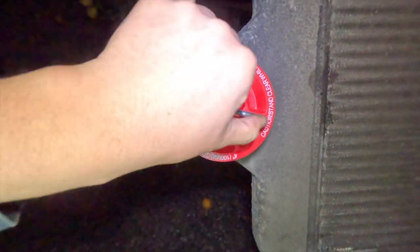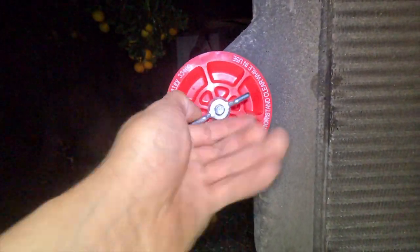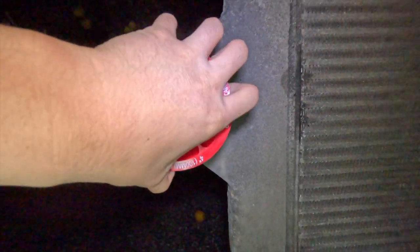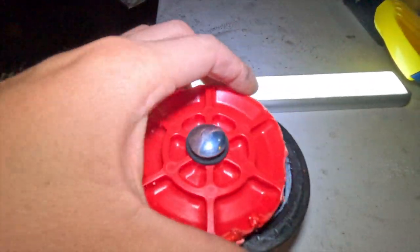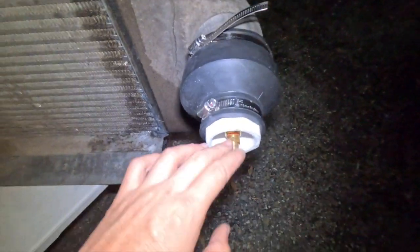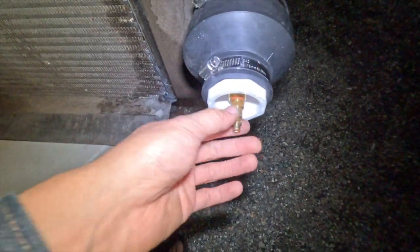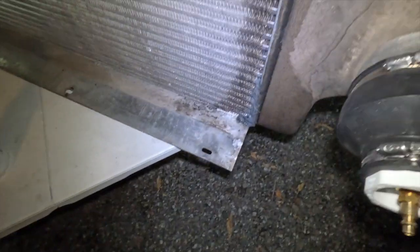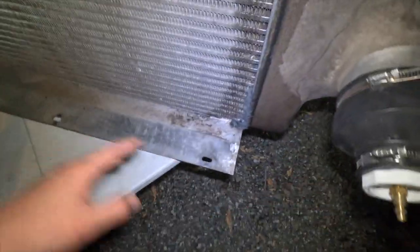I have finished the test, so I'll just assemble all these. This thing screws off just like this. I had to cut a little bit on the inside to fit into this hole, then just use this screw to tighten it up and it makes a very good seal. On the other side, I put air in. But remember, it has to be low pressure — I only put about 20 psi to this port, and then used some soapy water spray on it. It will bubble. Before I had it fixed, this thing had no pressure at all. Whatever pressure or air I put in, it just leaked right out.